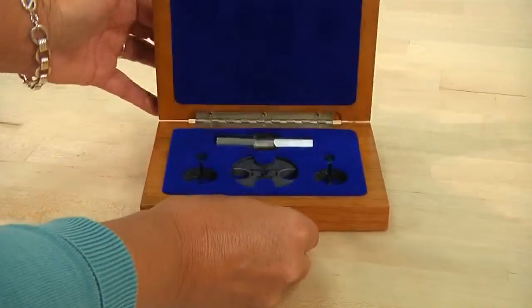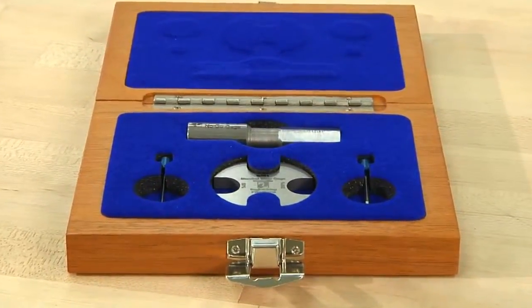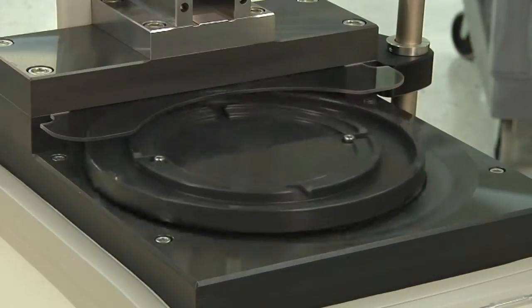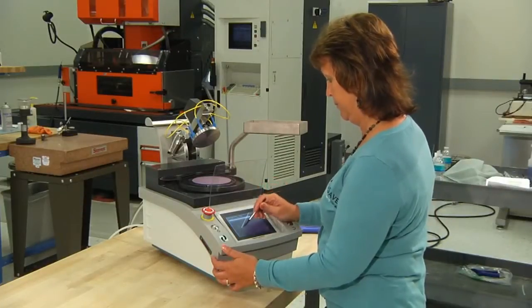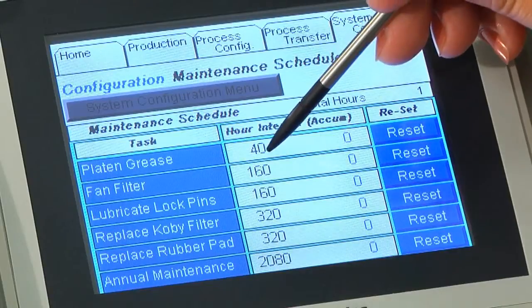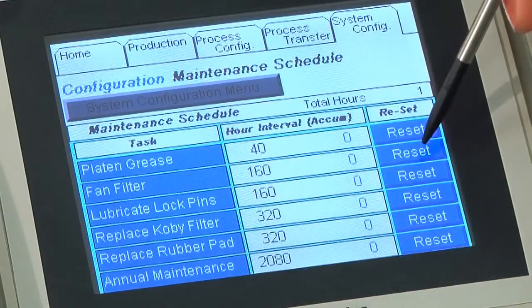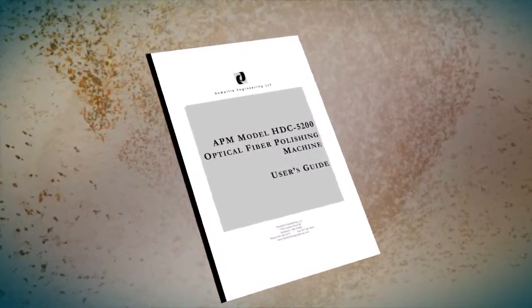Through time, metal on metal will cause general wear and tear. The easy kit can assist in checking your machine's surfaces, identifying what parts or maintenance is needed. When you start the machine, the plate will move, so keep your hands, hair, loose clothing and jewelry away while the plate is rotating. The maintenance screen allows you to define six specific maintenance parameters, including platen grease, the fan filter, lubricating lock pins, replacing the COBE air filter, rubber pads and annual maintenance. When a maintenance interval is reached, an alarm will be triggered on the production screen — the Maintenance OK box will turn from blue to red. Click the red reset after maintenance has been completed to reset the maintenance schedule. You can also change the maintenance intervals from the screen.